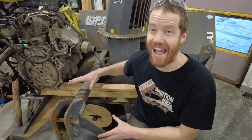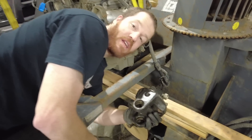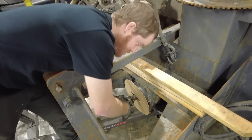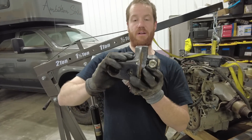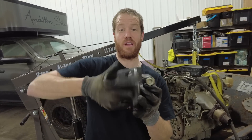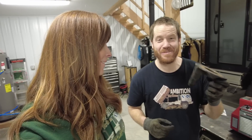I'm not going to lie, this whole project kind of terrifies me a little bit, especially when I start looking at how big and heavy all the pieces on this blower are. There's a lot that could go wrong. This is the shear pin coupling — if you jam up the blower, those bolts break and allow it to rotate freely so you don't damage the blower or the tractor. But I need a way to put a pulley on here, and I think the part I need to machine weighs more than the machine.